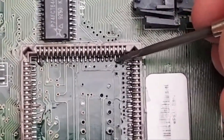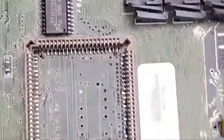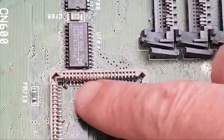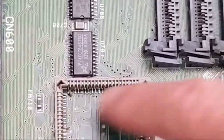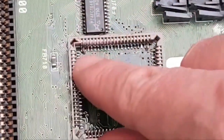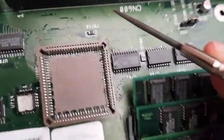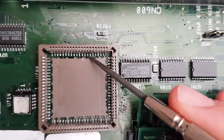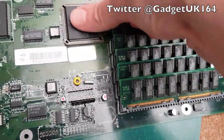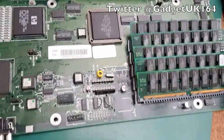The shape of some of these joints here — they don't look great but they are flowed. You can do the test: just try and touch each one to see if you can move it. I can reflow it later — when I'm not on camera I'll get some flux all around again and do some drag soldering, just drag the iron across and they'll all look really nice, level and smooth, like factory finish. I do that all the way around, then clean it all off with cotton buds and the brush. The little bits of plastic I'm leaving might help when we stick the base back in. You can see I've fitted the base back in here — the solder points aren't bad at all, they look a bit blobby but they're pretty tidy. There we go — and despite the fact that socket is not as structurally sound as it should be, it's not that bowed out. It looks all right. Anyway, thanks for watching, I'll catch you in the next one.